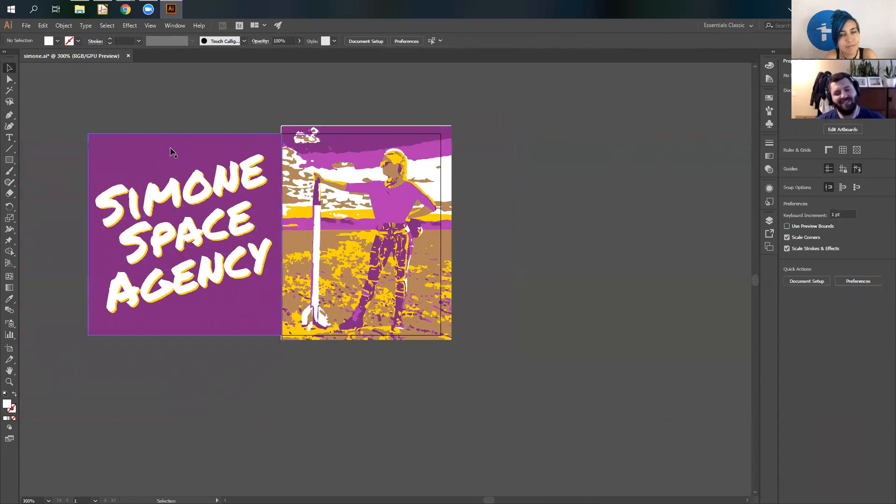This is a finished mockup of what it's going to look like for PCB art. Using this mockup, I now need to make three different image files to put into my PCB software. The three image files are going to be for the copper, the solder mask, and the silkscreen. Using those three different layers, you create the five different colors — it's a weird thing to think about, but with three layers you get five different colors because of how they interact with each other.